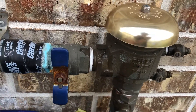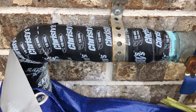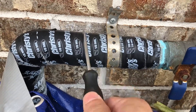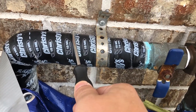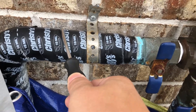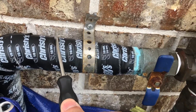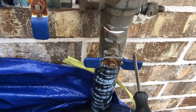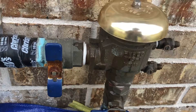For extra precaution, I'm going to turn on my sprinkler system so it will use up whatever water is still inside these pipes all the way to the sprinkler heads. That ensures there's no water in the pipe, so there will be no pressure even if it freezes. There's no water here now because we just bled it and the water supply has been cut off.